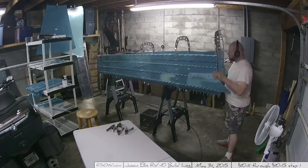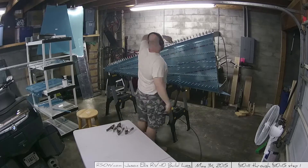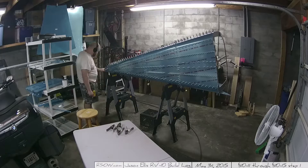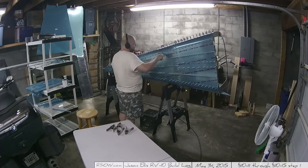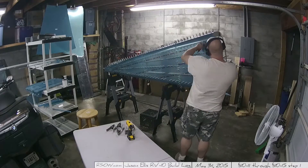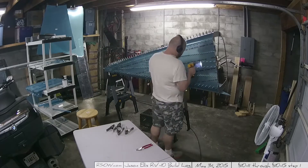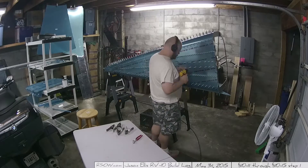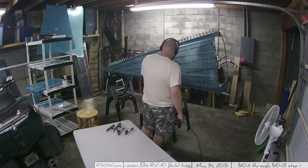You'll eventually get good at having a drill in one hand and cleco pliers in the other. If you purchase one of those pneumatic cleco systems, that might make your life easier — it's just a trigger in each hand. I'm going through moving clecos one at a time and drilling, and by the end my hand was tired. There's definitely something to be said for getting a pneumatic cleco puller.